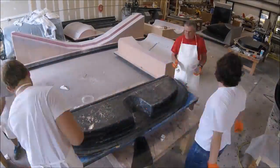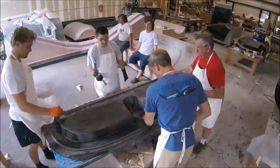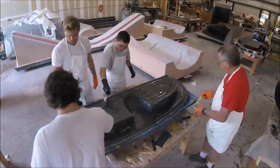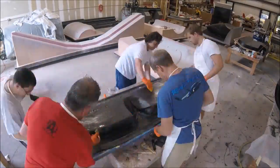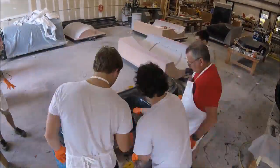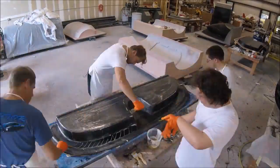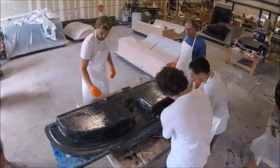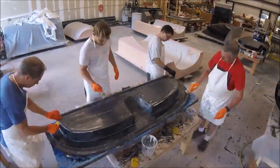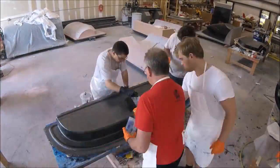So this layup is one layer of light fiberglass, two layers of light carbon fiber, and four layers of heavy carbon fiber. There's the second layer of lightweight carbon fiber going in. Our new summer hire, Keith, joined us starting yesterday - I think he's going to work out well for us, fitting in nicely so far. There's the first layer of heavy carbon fiber going down. We put down the four layers, and this actually went really easy because that heavyweight carbon fiber just lays down so nicely - it spreads out and conforms over all sorts of different shapes without too much effort. Finally a little bit of peel ply on the tunnel where it meets up with the keel.